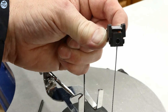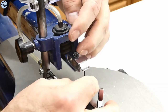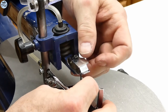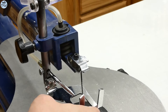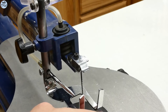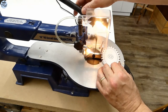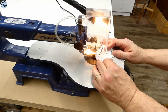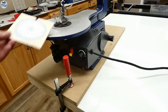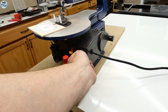Here's how the pinless adapter fits into the standard pinned blade cartridge. To change out a pinned blade, loosen the tension knob and put the pinned blade in the carriage. Tighten until you can hear the tension ping. Too loose and the blade pops out of the cartridge; too tight and you break your blades. You'll figure it out with some experience. The Rikon also comes with a pretty bright work light to highlight the work on the table and provide a better view of the lines you're cutting.